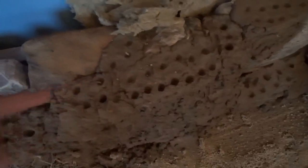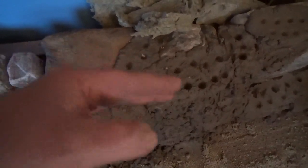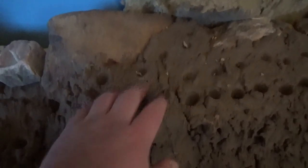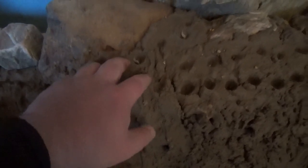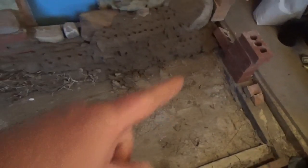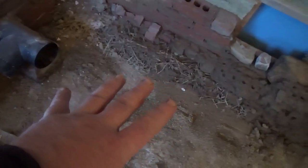I like to put quite a bit of mortar cob against the back just to support the rocks, because the flat face is facing the bathroom but underneath there are all sorts of shapes. So I've had to use cobs underneath it. That's been left a day or so and it's really stiffened up. That could be built on top of now to bring it up to bench height, but I'm not going to yet. The next job is to use stabilised clay perlite on the floor and fill in this section here and get that completed.